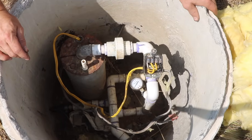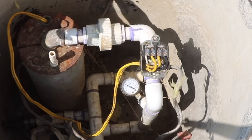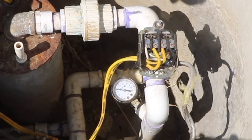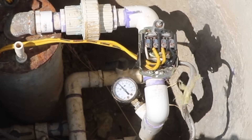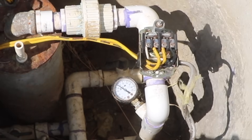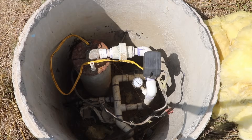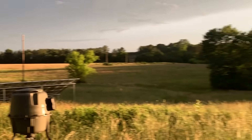So I turned the power back on and it worked fine. I had a bunch of footage and was explaining what was going on but the wind noise was so bad I didn't know what I was saying, so I'm just doing this voiceover. You can kind of see the pressure gauge going up and down — that's it cycling between the low and the high — and everything worked fine. So I expect that pressure switch to continue working for many years. What's to keep it from clogging again? Well, nothing. We have black sand in the well — that's probably the source of it — and I'm just going to have to check them periodically and clean them out. That one had probably not been checked in a couple decades, so it won't be that frequent. If this is your first time at FarmCraft, check out my other videos — I have way better videos than this one. See you on the next one.